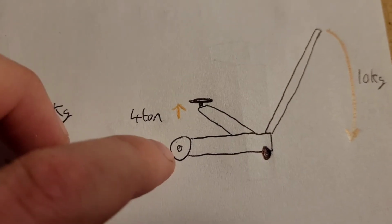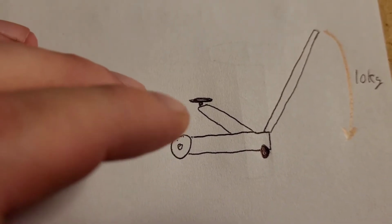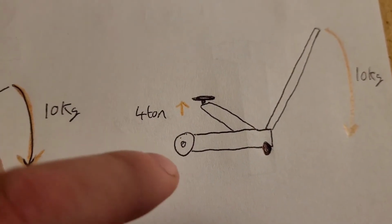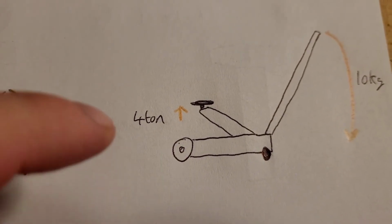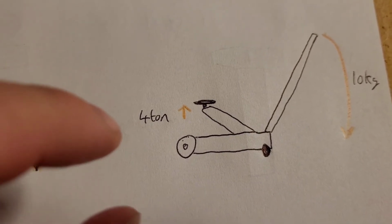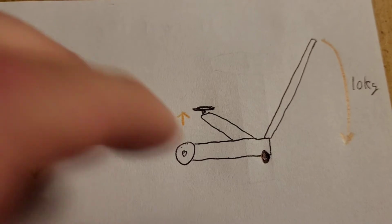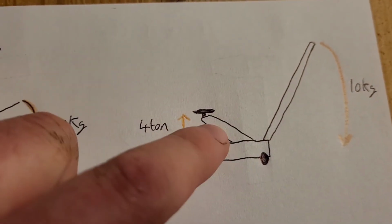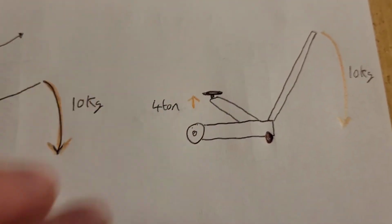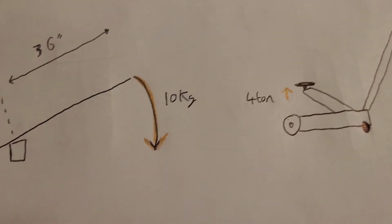You have a little pump that turns around at, say, the speed of the engine, so say 1,000 RPM or 2,000 RPM or in between. It spins really fast, and it's a little pump with little pistons or little gears, and it only pumps a little bit at a time, but it pumps a lot of it. And you have a big ram, so you pump a lot of times to move a big ram a little bit, and you have a lot of force behind it. So that's the basics of hydraulics. It is sort of leveraging.